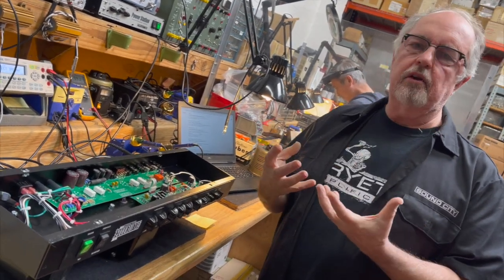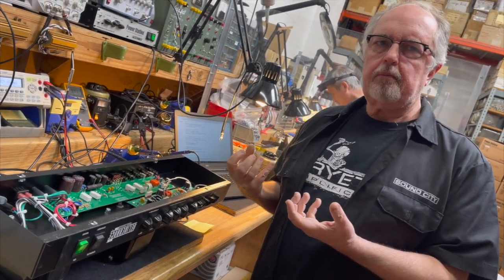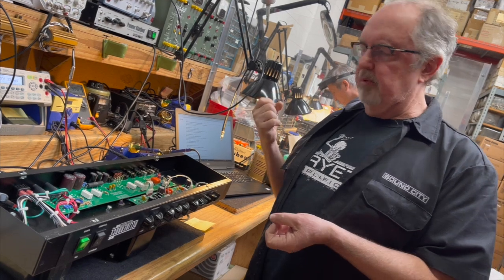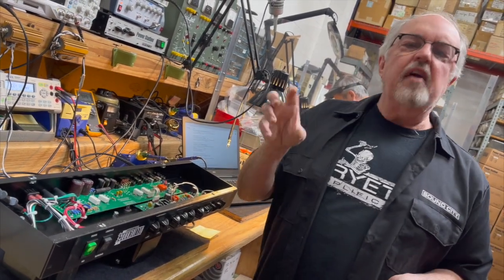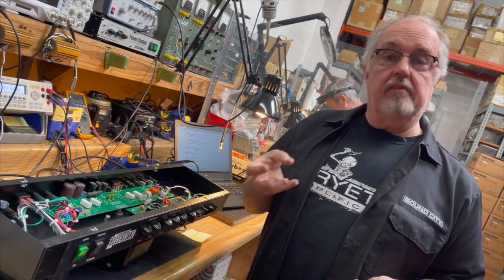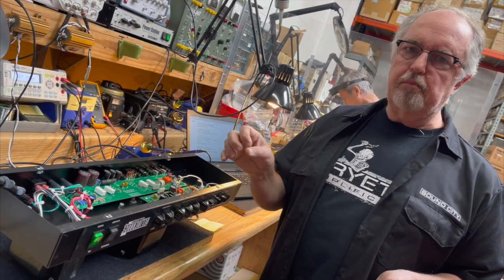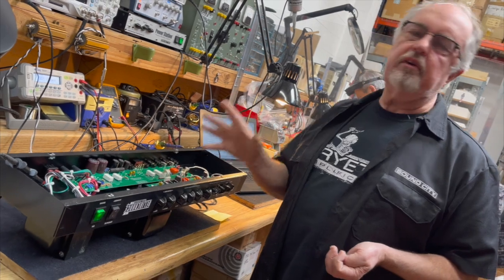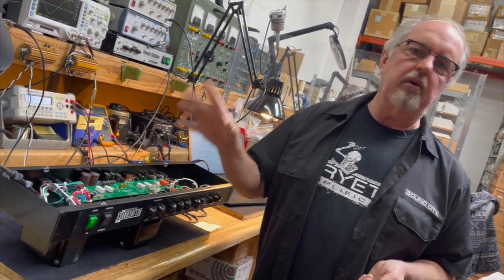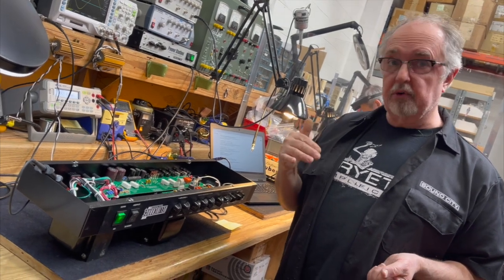There's a regulator circuit that you can buy as a kit that you can put in an amp. The name will come to me in a minute, but you probably know what I'm talking about. It's a variable high voltage regulator, so you can vary the voltage going to the tube plates, and you can select whether you want only the power tubes and the phase inverter, or the power tubes, the phase inverter, and the preamp tubes to all be affected by this varying voltage.